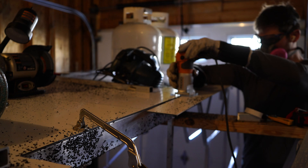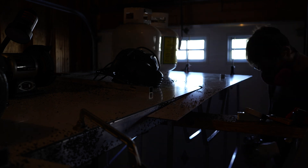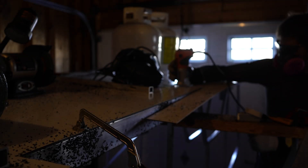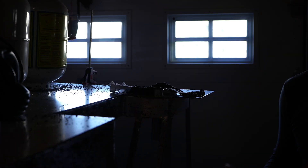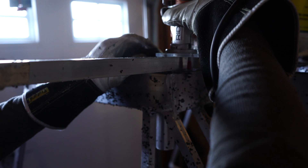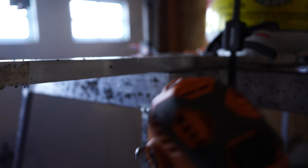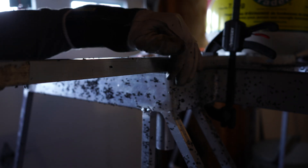Now for another very satisfying part of the project — using the flush-cut router bit to rout off the sides so they're perfectly flush with the frame. There's just something so satisfying about doing this. I couldn't get the router around the protrusions of the dropout legs, so I added some spare scrap aluminum to create an edge higher than the protrusion. Just be careful at the corner — you run out of material for the guide bearing and the bit can go right into the bar you have clamped there. That jumped out at me, so heads up.